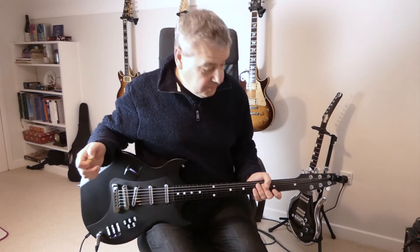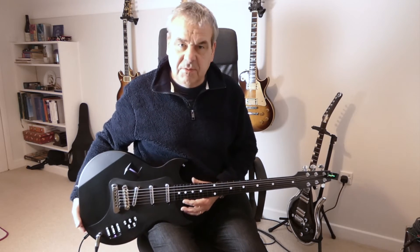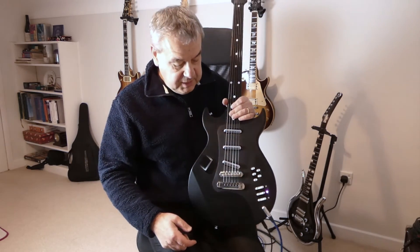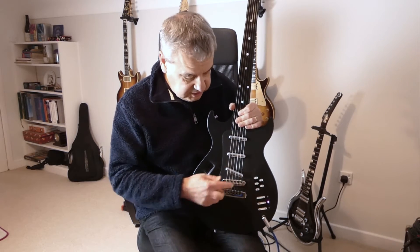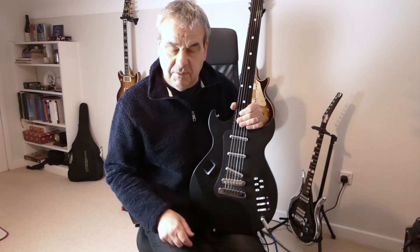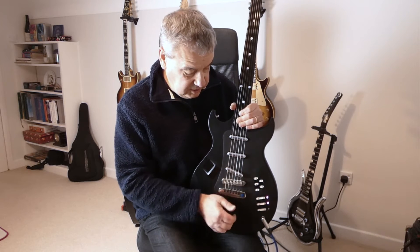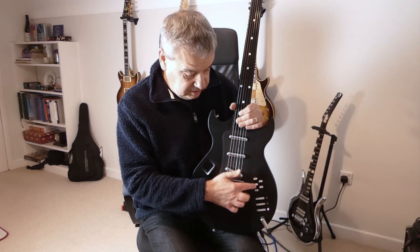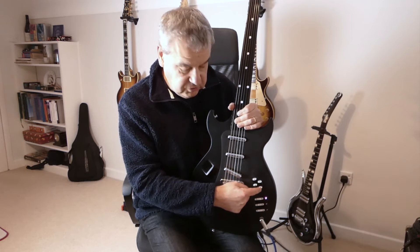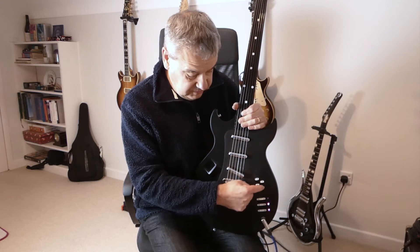And back in the room. Here's the guitar, all plugged in and working. Just some quick points around the actual controls themselves. I've actually set up these three capacitive touch controls here to be the switches for the different pickups. At the moment it's on the middle. You can see with this LED here - I can turn on the neck, turn on the bridge, and just play around to my heart's content. I also have a control that lets me switch automatically through them doing different combinations.